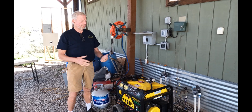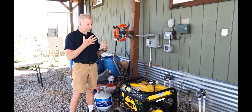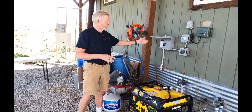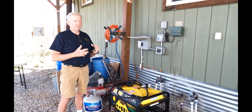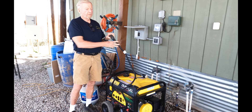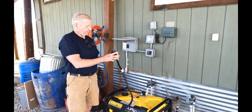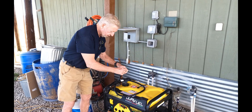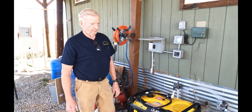That's the simulation — it'll save your day. It's a lot cheaper than having a big generator with a transfer switch. Just go through the steps: shut the main off, shut this breaker off, and make sure you have everything plugged in before you start energizing. That's what I have to emphasize — have everything hooked up before energizing, because the outlet becomes electrified — we call it 'hot' in the field. You don't want anyone touching that.